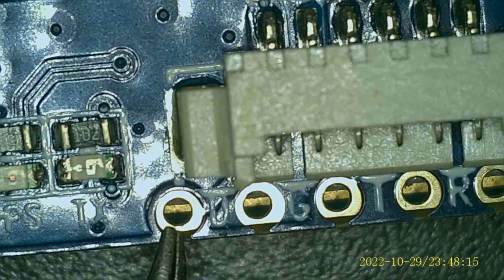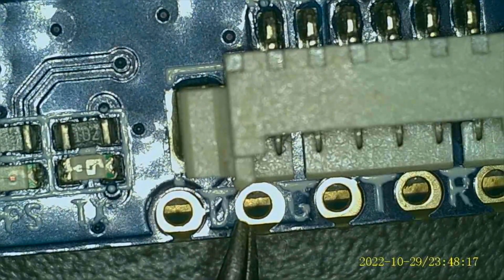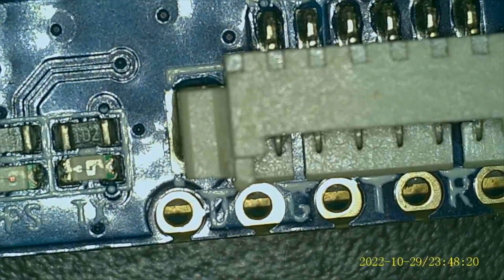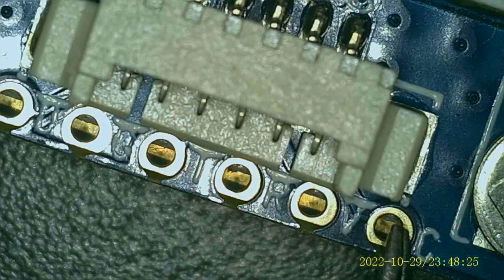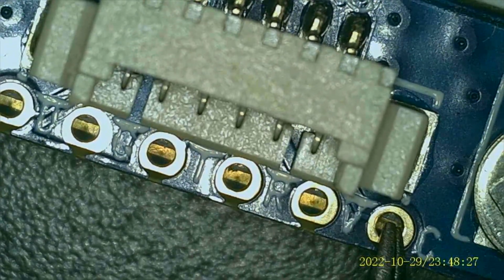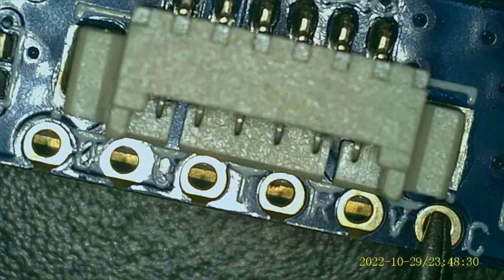All right. So in order to wire this up, what's nice is that they come with a wiring harness already set up for it. You just plug it into the BN-880, and then you pretty much just have to solder it into your flight controller. So this is your SDA plug right here. This is going to be your ground. This is TX, RX. This is VCC, and this is actually SCL.